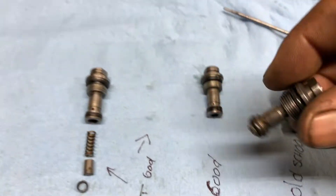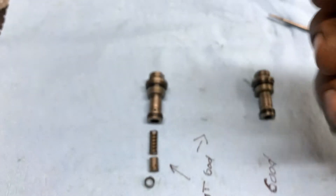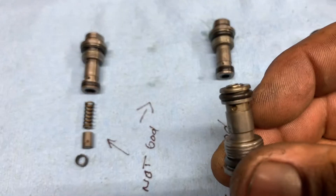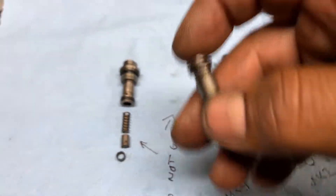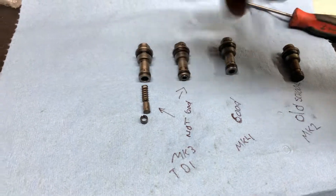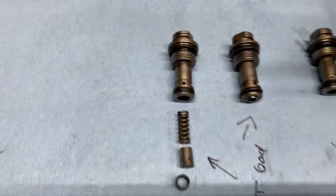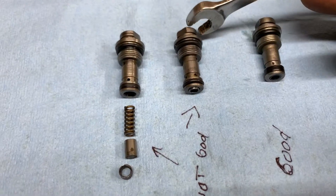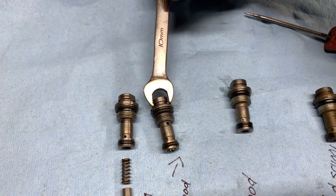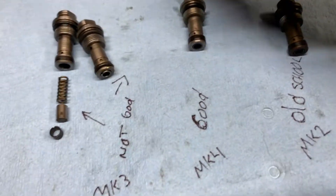Today I'm just trying to show you guys this is so simple — you only have to push the clip back, that's it. You need to push it all the way back. You just need to get the valve out with a 10 millimeter wrench. I got them out with a 10 millimeter wrench, so it wasn't that hard. If you can't get it, you can put the wrench like this and twist it — you will be able to pull this thing out.